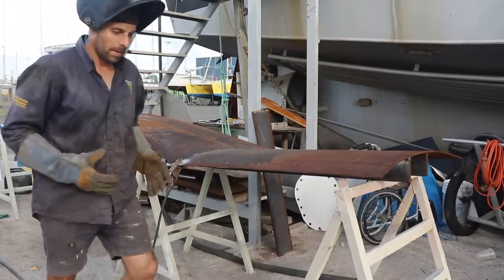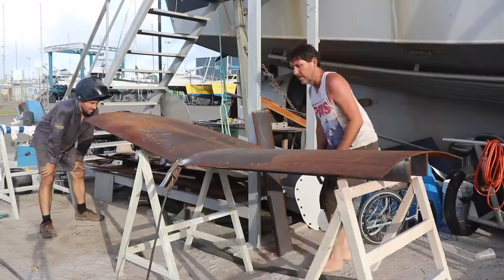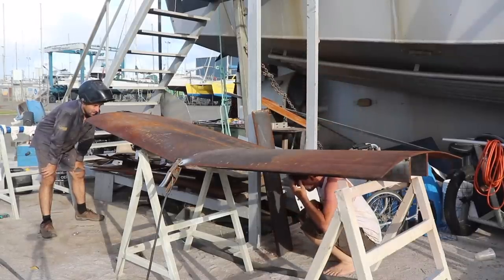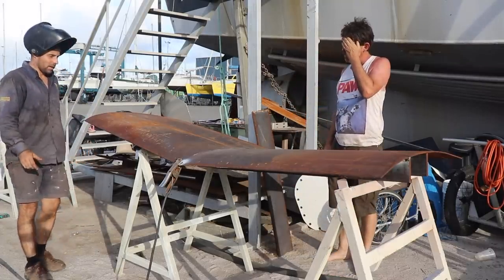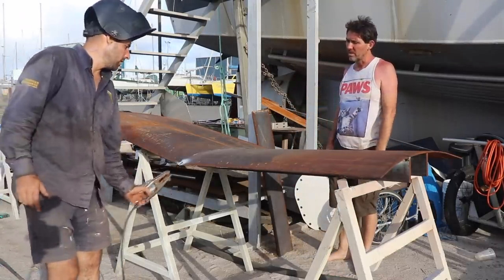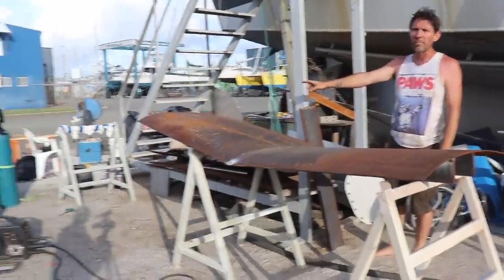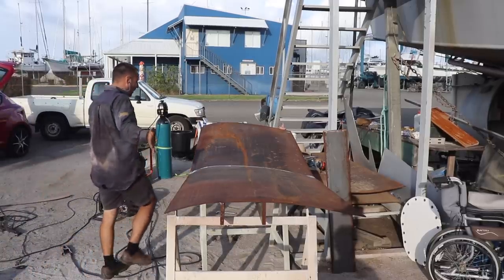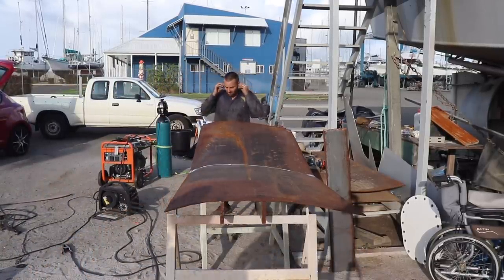Yeah, right. What's the gap between the... Oh, not much. There is a gap, but it's only 3 mil. Oh, it's definitely fillable. We're going to be double continuous welding it anyway. The gap might actually give you a better join anyway, you know? Yeah, true. All right. Okay, so we need to know if it's straight. Yes. And you need to kind of tack that end to the uprights as well. Yeah. I was thinking, like in a way, a flat edge. We could put it down there and there. Oh, you know what you got? You've got some.